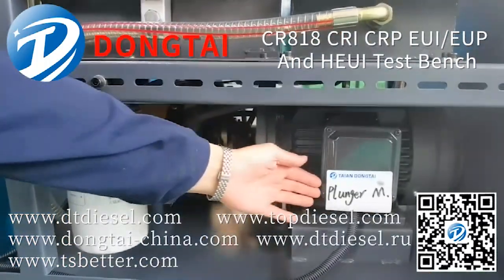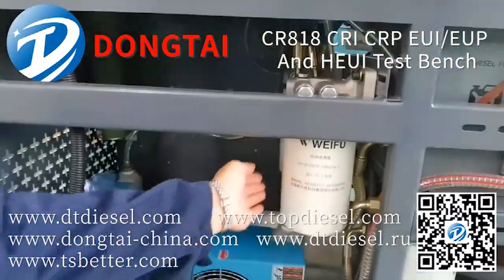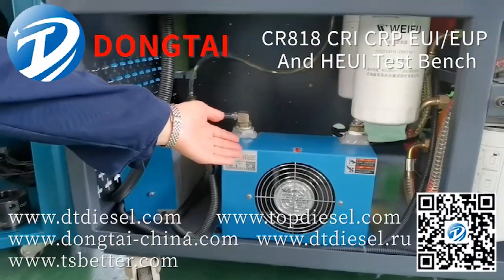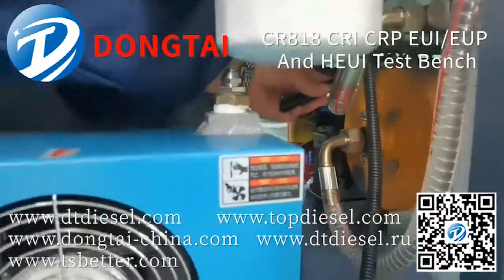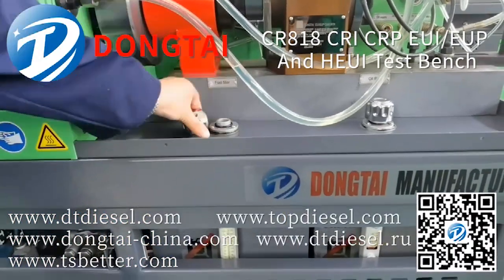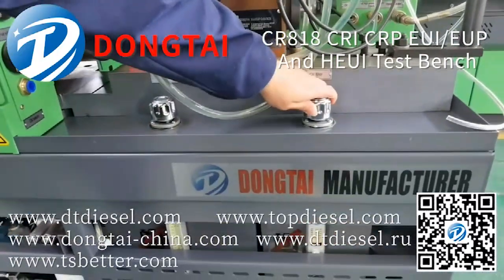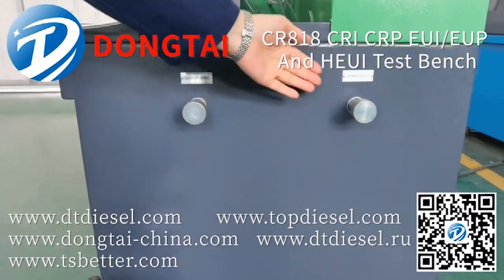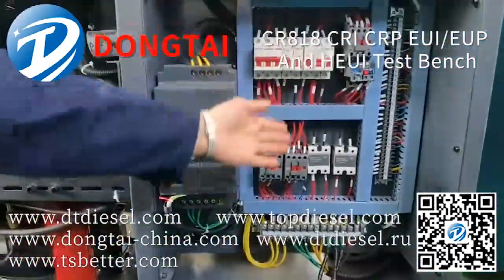Also, we have the plunger pump motor. This is the two filters for diesel oil. This is the filter for engine oil. This is the cooling system. This is the plunger pump. This is for putting in the diesel oil. This is to add the engine oil. The fuel pressure regulating and oil pressure regulating. This is the cable connection for this test bench.